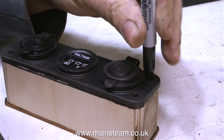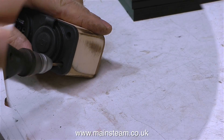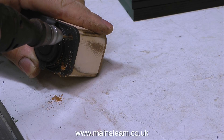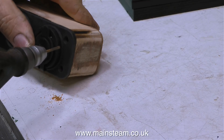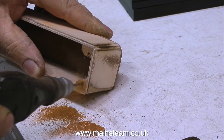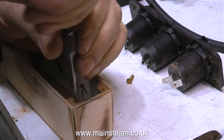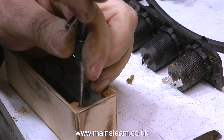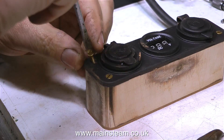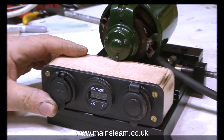You may have noticed that I've fitted some pieces of shaped hardwood on the inside corners of the box. I'm now marking this with a felt tip pen, followed by drilling some pilot holes with my small mini-craft drill, and then I'm going to thread these holes to take some 4BA countersunk bolts. Once I'd made a pilot mark with the drill, I removed the front panel and drilled the holes deeper down into the pieces of hardwood, then threaded these 4BA holes to take the bolts.